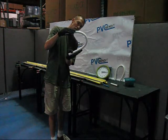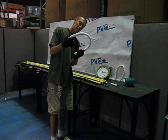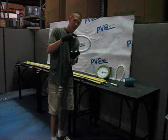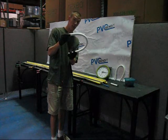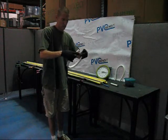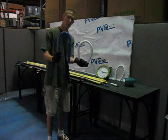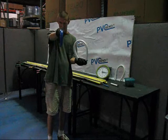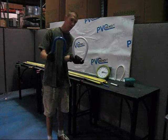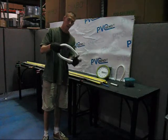By setting a better form, you can avoid all of that mess. This is all this pipe is going to give us freehand. What I'm showing here is a raw, rough, basic result — if you set a good form, you can get tighter than this. Here's an example: this is also three-quarter inch Schedule 40 PVC pipe, and this one we used a form. There's not any ovaling going on, and we were able to make a four-inch inside-to-inside curve just by setting the right kind of form. This freehand result with no internal or external support — that's what we're able to get.